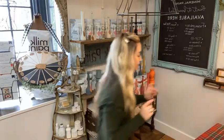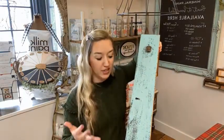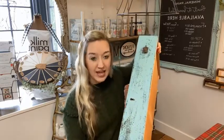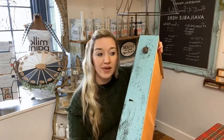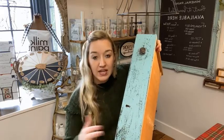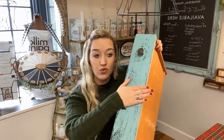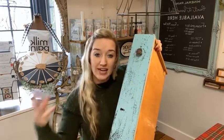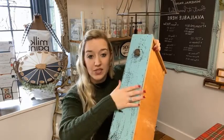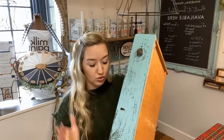Sometimes things don't happen the way you want. I was preparing for a show and wanted to use a drawer to demonstrate the chippy look. It had a shiny surface so I thought I wouldn't need the ultra grip. I painted it out, let it dry overnight — because for milk paint to chip, all the water must evaporate out of it. Here's a tip: if you put your hand on it and it feels cold, water is still evaporating and it's not done drying. You need it to be completely dry before the chipping process can happen. I came back the next day and had no chipping at all. How was I supposed to show the chippy look with my unchipped drawer?